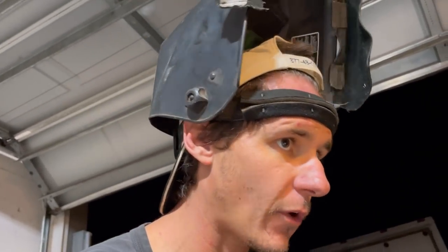What I'm gonna do is, because these are all welded. Every other mount is welded front and back. I'm 100% positive that they're good. That one's only welded really good on one side. So what I'm gonna tell the customer is that it's welded good on one side. And I mean, most of the mounts on this thing were only ever welded on one side. So there's that. But I'm gonna tell the customer that if he wants me to weld it on the inside, he needs to pull the motor up for me now that the mounts we know are set in their place.